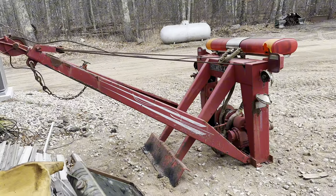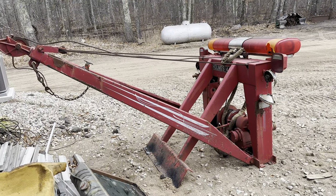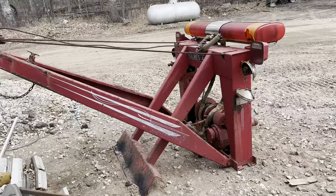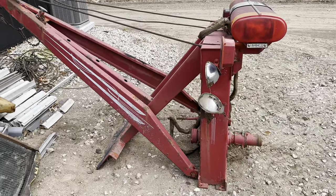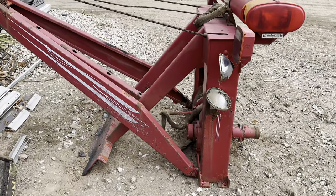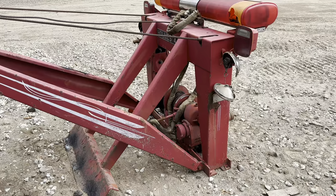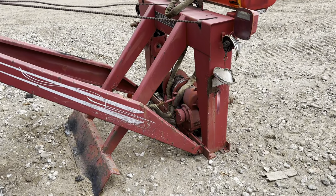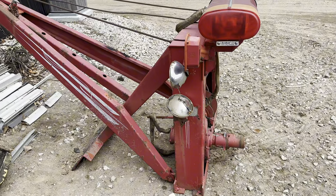Hopefully when I get back from vacation we can get back on this and get it done. Gotta wait for a valve body with a remote. I'm gonna plumb it into a Bobcat power unit, so when you hook it up to the Bobcat you can just hook in the plug-in and then your remote will work for the remote valve body. So I'll have a remote winch — that should work pretty slick.